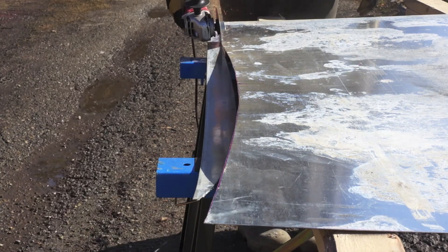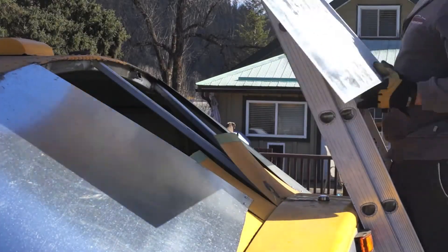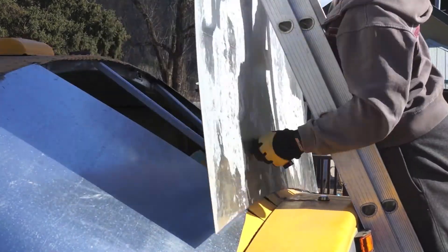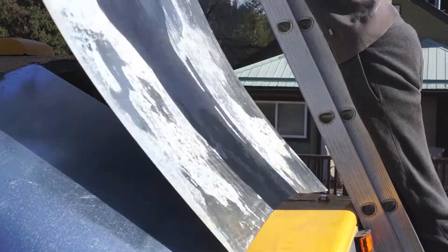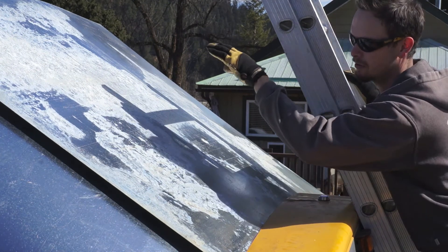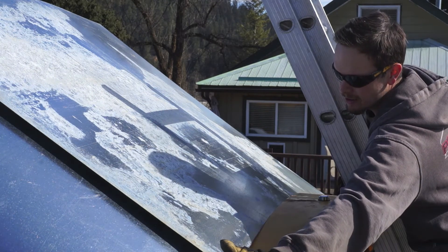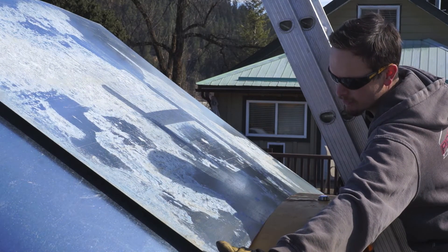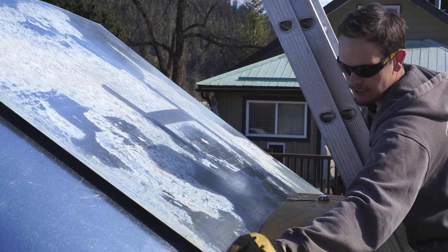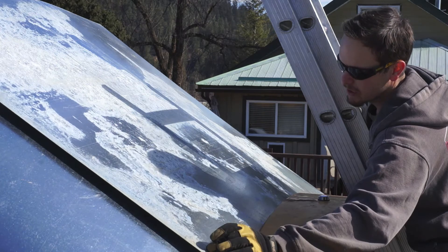I'll mark that line there and keep moving it along. Now that I know that it fits, I'm going to push it up onto the top of the roof and fasten the sheets that are underneath it. I'll also run a bead of sealant — a nice thick bead along there so nothing can get in when I do rivet this.